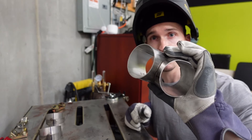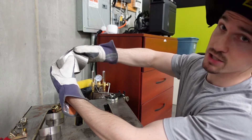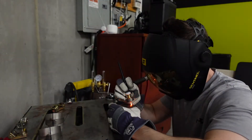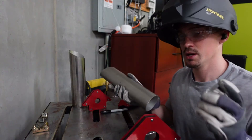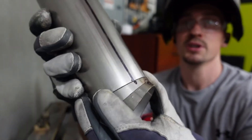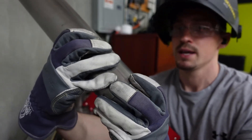After the pie cuts, I'm going to do the merge collector. There are the two pieces together — this one can be a little tricky to tack weld, especially if fit-up is not perfect. We're going to do two tacks here and probably one further down, so six tacks total. You want to use permanent marker to mark where you're going to go, because it's really difficult to hold these things in place. Once you kind of get where you want it, put a little line with permanent marker on either part. If you don't make marks like this, it's going to be really hard to stay precise, and you can also copy the marks to the other parts so it's equal on both sides.